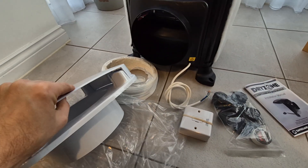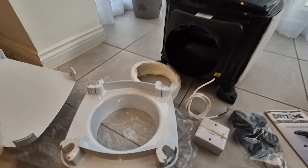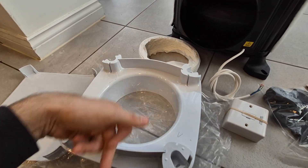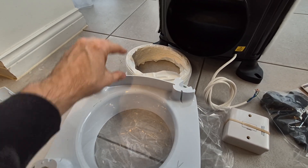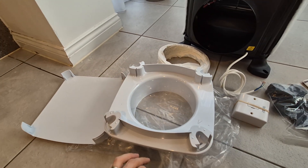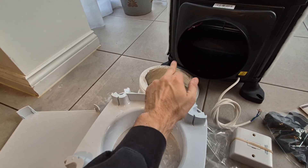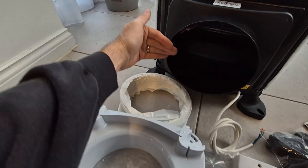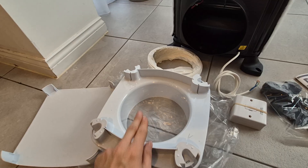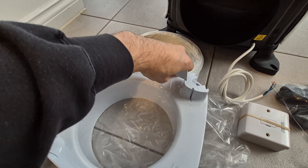Through the ducting it goes into this diffuser — it's quite a neat diffuser. These are the blanking plates, which stop air going out of two of the sides. For example, if you have a smoke alarm nearby, you need to make sure the air does not hit it — use a blanking plate. Also if it's a narrow hallway or landing and the air would hit walls too quickly, causing a draft, blanking plates prevent that. They simply slot up and down like that.